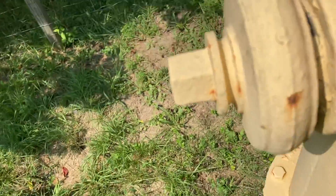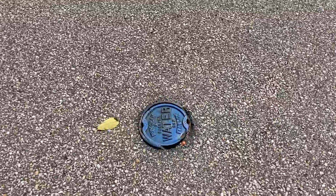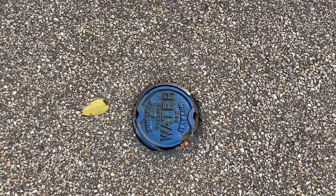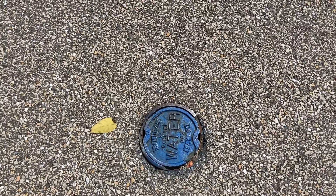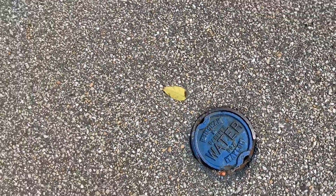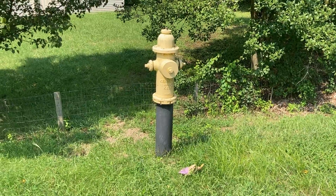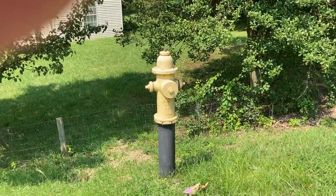The isolation valve looks like the top's been hit by a snowplow here on the valve box. There's no evidence of the direction on the valve box. If I come back in five years and see it in this same direction, it's obvious that they're not exercising the valve when they flush the hydrant, which they should be.